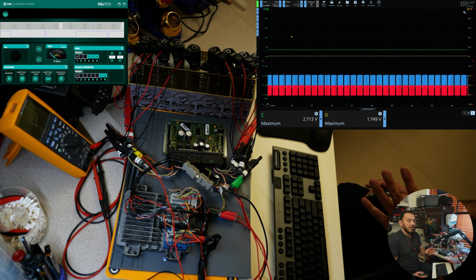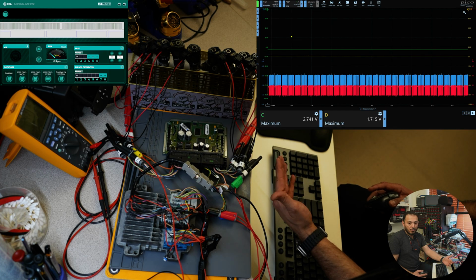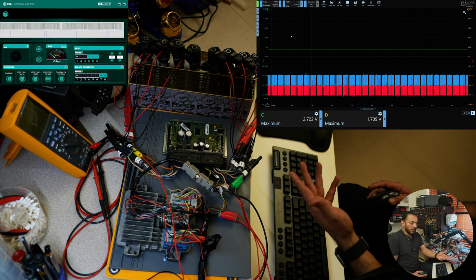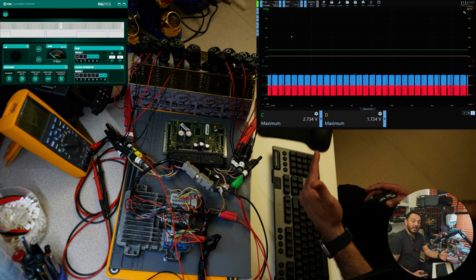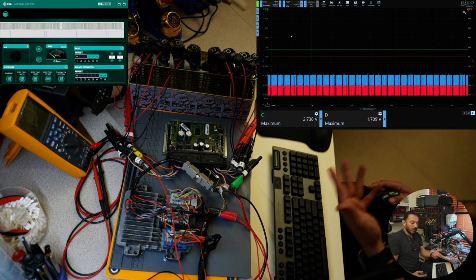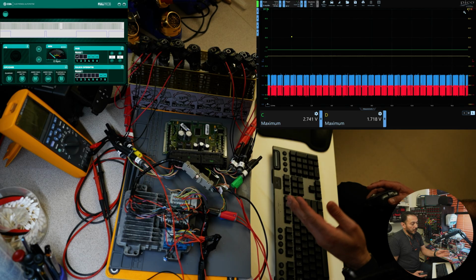The yellow and the green channels that I have in there are connected, the green to one bank of injectors, which this time is on your side, the right side, and the yellow is attached to the other bank. The way this module works, if more than two injectors fail, it will not run that bank to protect the engine and the module itself. It will attempt to make it run again every time you cycle the key. So if you have a problem, stop, call me, and I will guide you through so you don't burn your FICM or damage your engine. That's the way the system works.